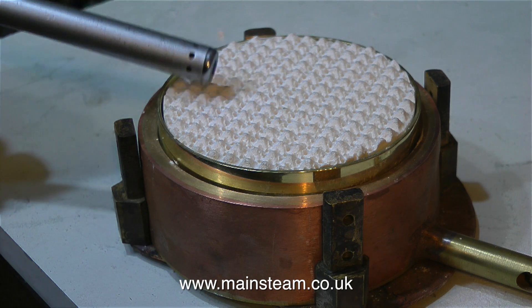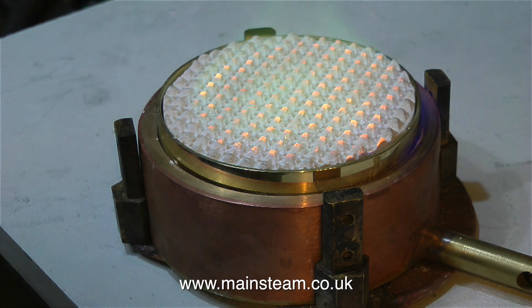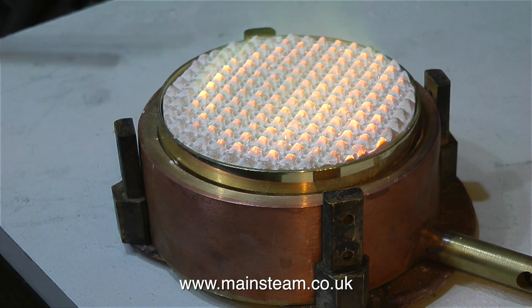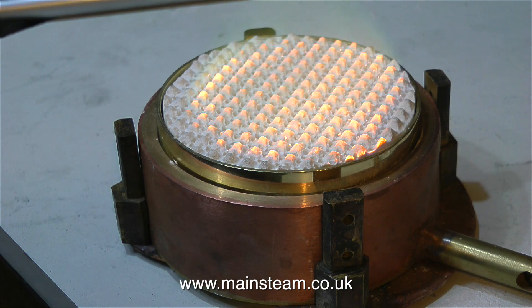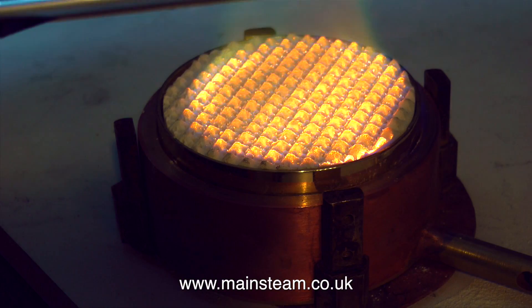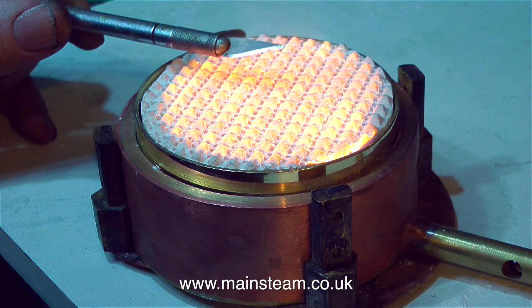In this clip I'm lighting the burner — I've connected it to a gas supply. I'm going to dim the light slightly so you can see the warm glow coming from the ceramic burner. A warm glow is possibly not the best way to describe it — this is a very, very hot flame. I'm feeding the burner from a gas tank that's nearly empty, so what's left in there is mainly butane at low pressure. But nevertheless, it's a success — this is a very good burner. It's January in England and very cold up north, and in my workshop the burner warmed things up considerably, which is a first. I can detect a slight blue flame around the edge but this will disappear when I seal everything with some fire cement.